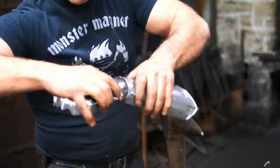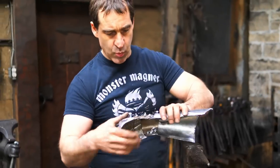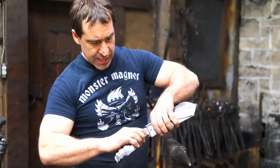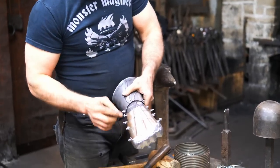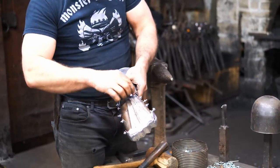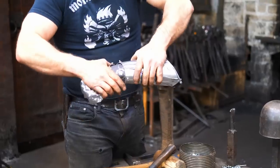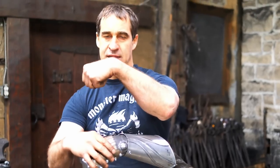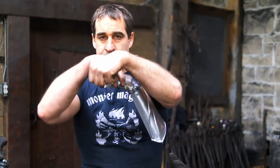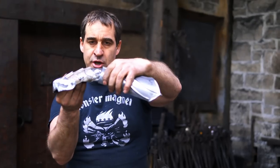It is moving there. I'll get some more bend out of that so I can get it bending down a little bit, but I'll have to wait until I get that together. It looks like I've got decent spacing in there. This is really the critical joint — a lot of movement happening here. This floater wrist piece and then these pieces coming off of it allow for movement this way but also to come down this way. I should be able to get something like 70 degrees coming off the horizontal and that should be sufficient to make this gauntlet work.